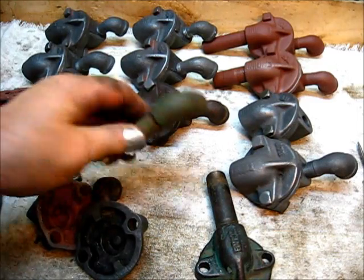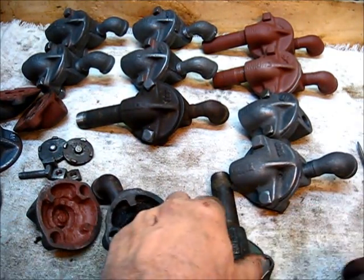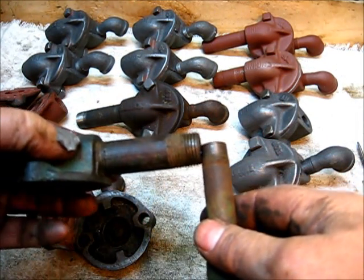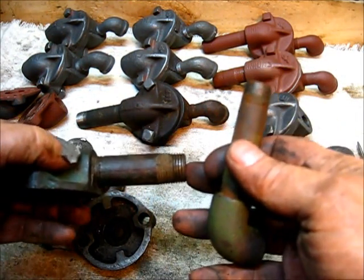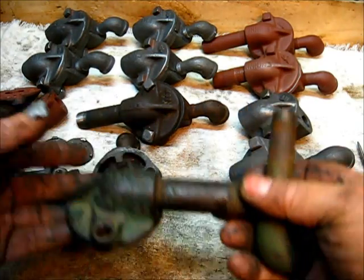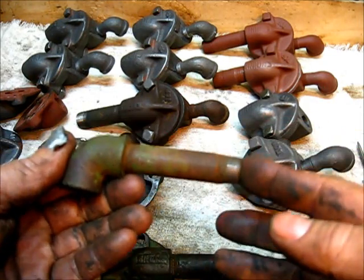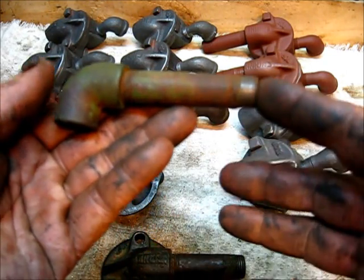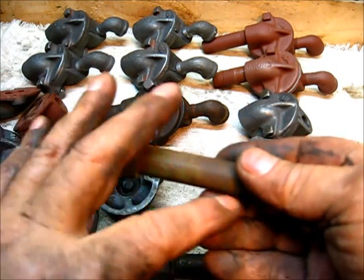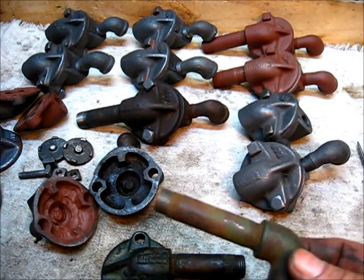To reinforce the difference between these: this is the one with the half-inch thread in the block — the later model. This one was actually on an engine I have here where the hole in the back of the block is 3/8 inch — it did not have a breather on it. That was the way it came from the factory.